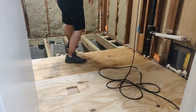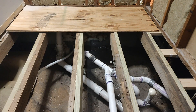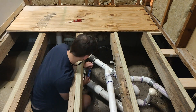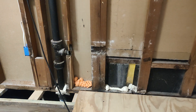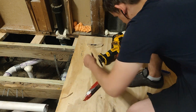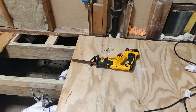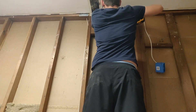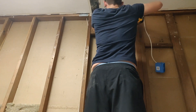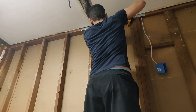Today we are doing a bathroom rough-in. We're going to cut this cast iron pipe with a carbide tipped blade and replace it with PVC. The vent pipe is in totally fine condition; it's just that there's this weird section where it used to join with the wet vented sink. I just need to replace that section, so I'm going to cut it up pretty high so I have plenty of room to work with the new PVC run.